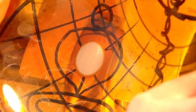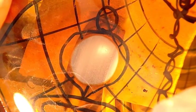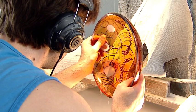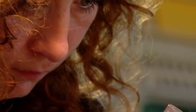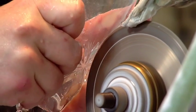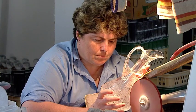Radius discs, which create large arched surfaces, are used for glass stems, bottlenecks, or bowl bottoms. Synthetic diamonds give the discs their sharpness. However, the beauty of the glass comes mainly from human hands.